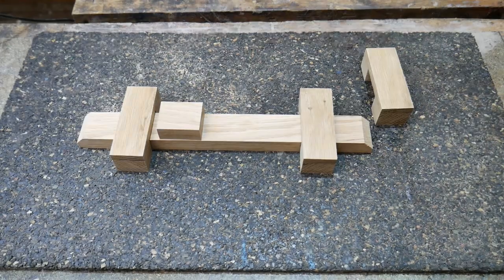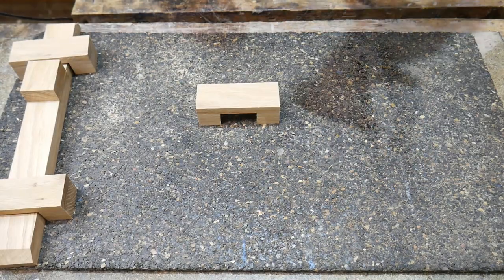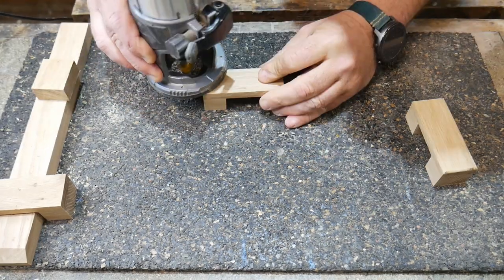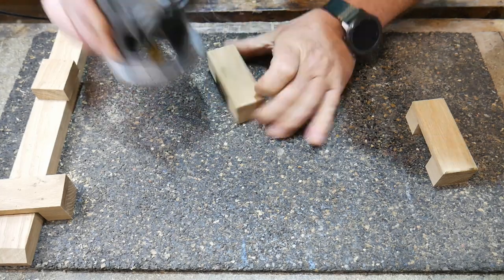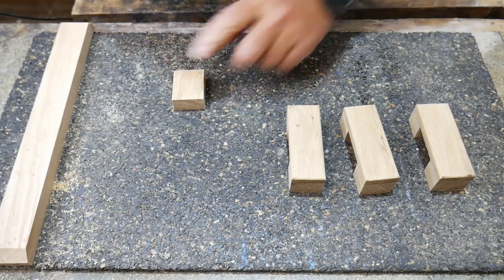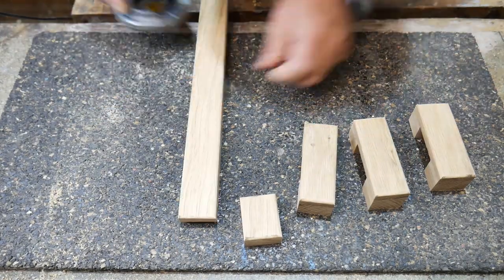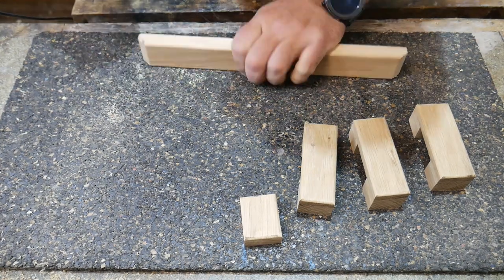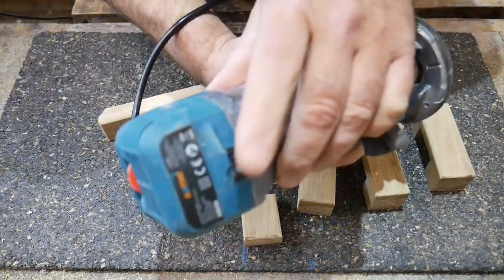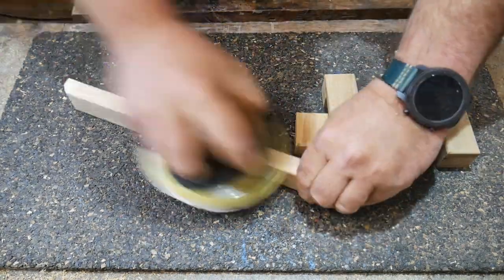First of all, we're going to clean it all up with this Katsu palm router - it's like the little Makita router but it costs 30 euros, cheap as chips. I'm using this dark black speckled mat - it was actually a soundproof mat for a washing machine. I bought one and cut it in half to make two mats. The nice thing about the mat is it grips your work - no clamps required. This is just an eighth round-over bit, about three millimeters radius, which does a fine job of cleaning up all the components and taking off the arises so it's nice and tactile.